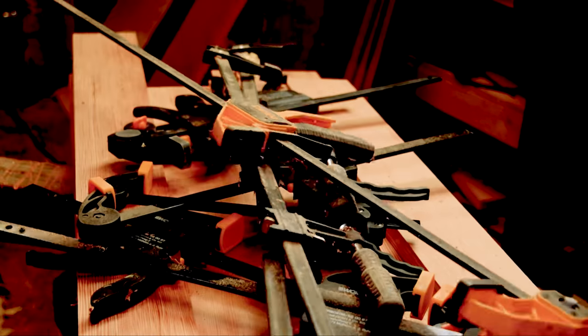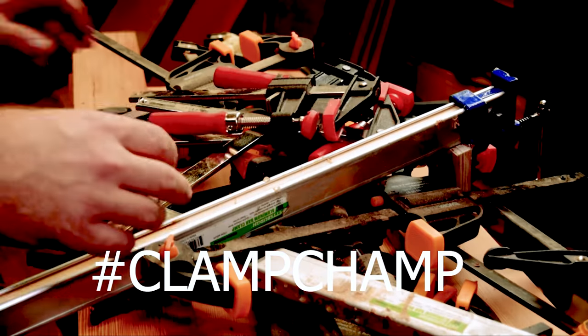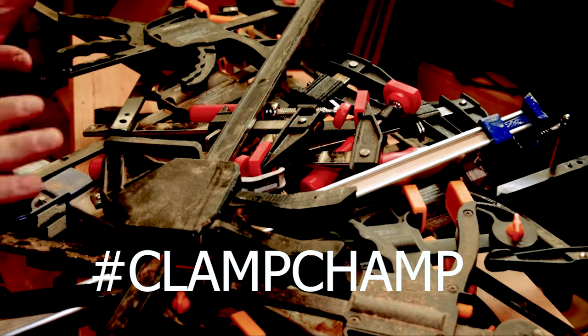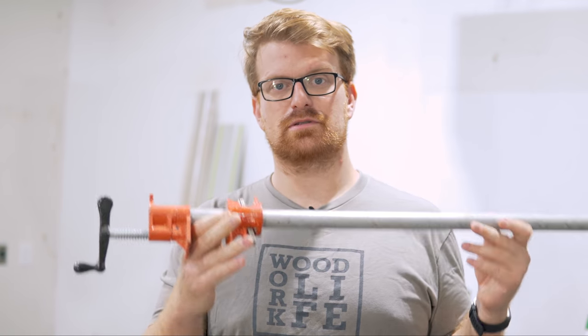There's an old adage among woodworkers that you can never have too many clamps, and I totally subscribe to this — I buy clamps almost every time I see them on sale. Clamps are definitely your first, second, and probably last tools you'll ever buy as a woodworker. I'd start with pipe clamps — they're the cheapest, strongest, and most versatile clamps you'll buy. You can add length to the pipe for longer reaches, and you'll keep using these throughout your woodworking journey. Just note that the pipe material can sometimes leave marks on finished work.